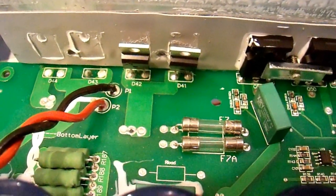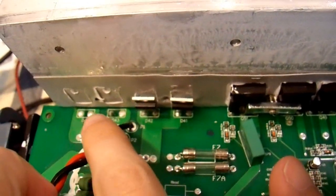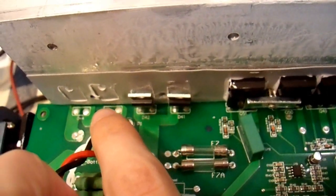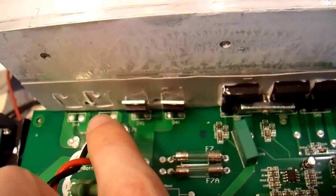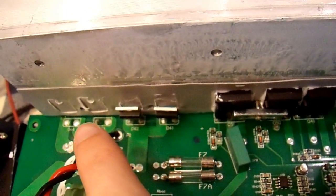I'm back, and this is a top view of the board. This is a bridge rectifier — there's two diodes over here, two over here. These two tested good; I just pried them away to inspect them. Over here, one was good and one was bad. My intention was just to replace the pair of diodes with new ones. However, I looked and looked and I could not find any diodes. I don't have diodes — unbelievable.